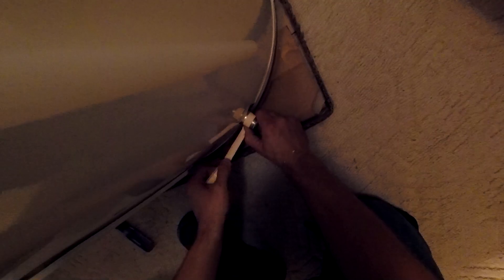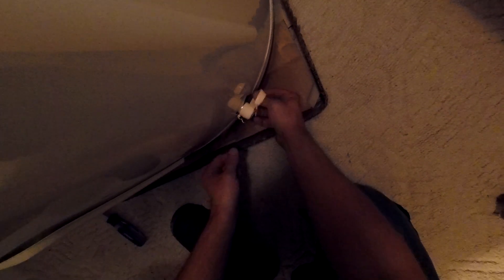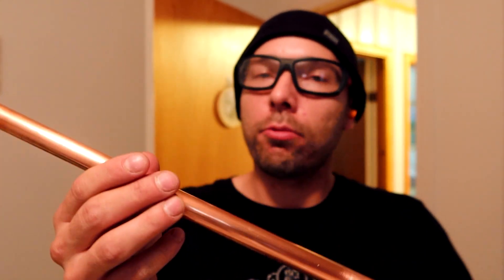I'm using a non-toxic pipe dope called Triple Thread that will not contaminate the water entering or leaving the unit. A lot of these pipe dopes have surfaced over the years and are really useful for threads on potable water systems, so keep an eye out at your suppliers. I went outside and soldered two three-quarter by half FIP fittings to two pieces of copper. I used one foot as a random starting length for each — the bottom one will be short and the top might be a bit short too, but we'll be adding shut-off valves and couplings, so I'll install them on the hot water tank and continue from there.